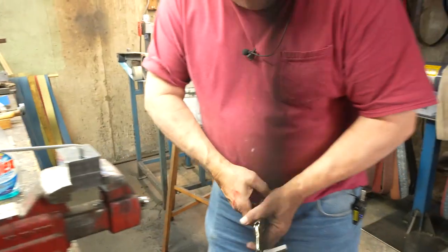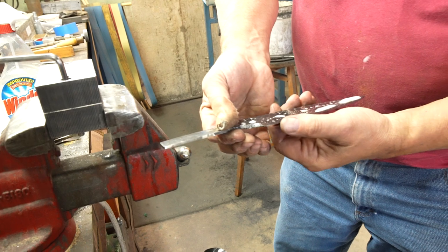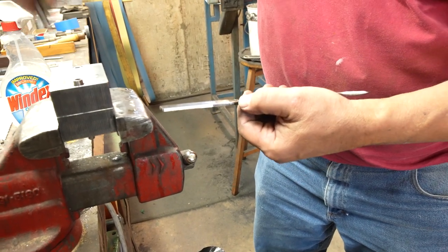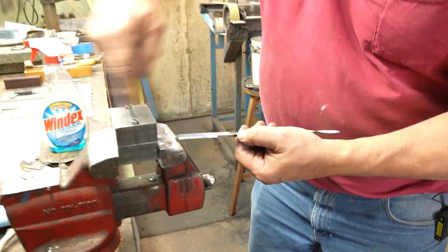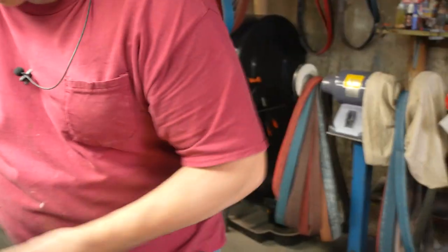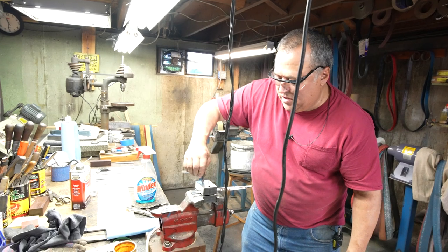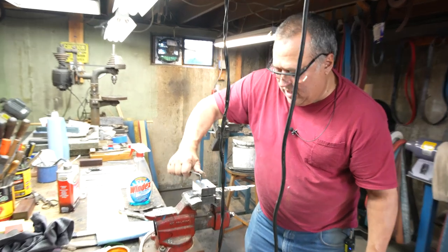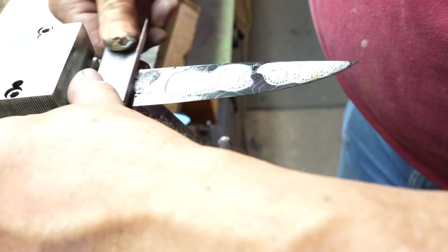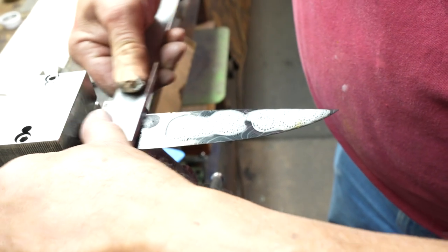Okay, so that black pattern's still there, but in order to continue the etch to make it deeper, I need to remove that black. I'm going to first try scrubbing with 3000 grit. I'm going to see how that looks. That should be able to take it off. Sometimes if I'm going to use a coffee etchant afterwards, I'll even use stainless steel wool, triple zero stainless steel. Rub that here back and forth. Again, this is 3000 grit versus the 800 I had put on there.